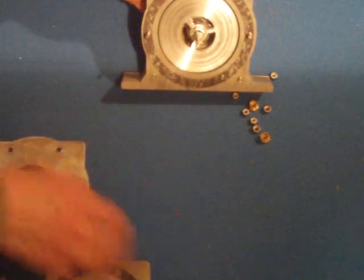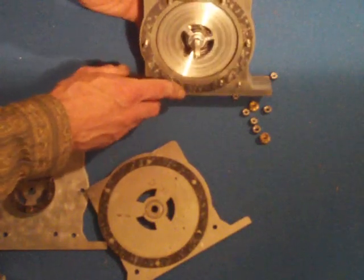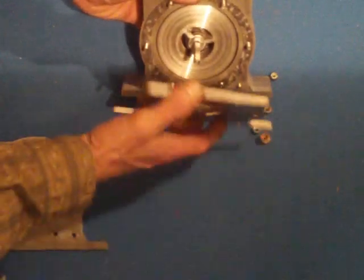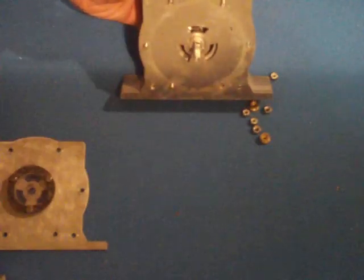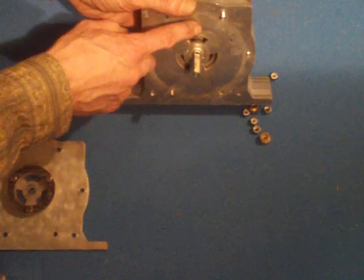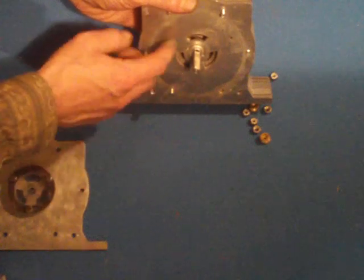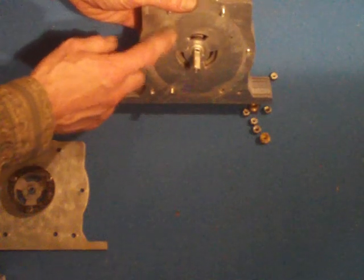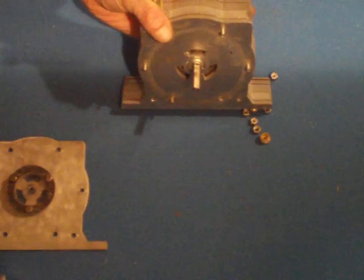We slide the rotor into the turbine slowly — no grease required. Then we place either a 1/64th or 1/32nd gasket depending on what you've done with spacer washers, and assemble the bearing case. The hole pattern is specific so these plates go together in one order only. They're identical side to side but face a certain direction only, so mark them inside or outside with a marker for fast assembly.